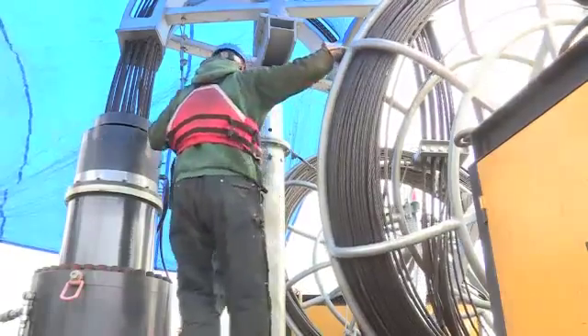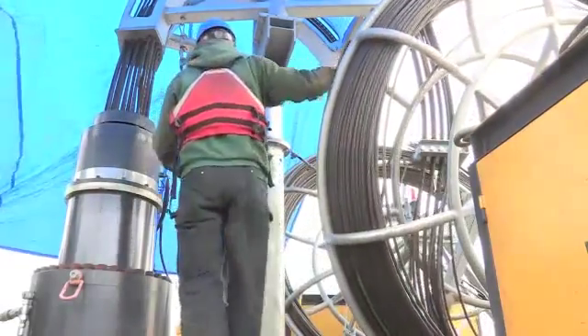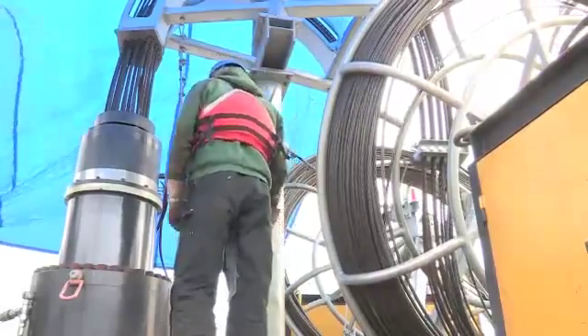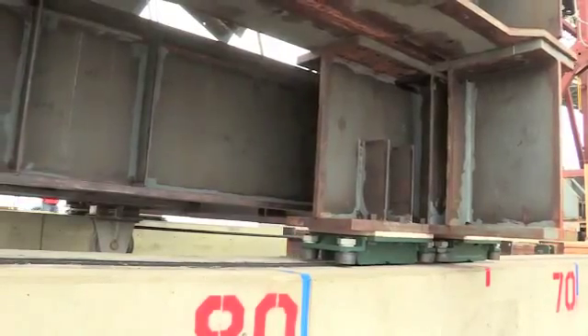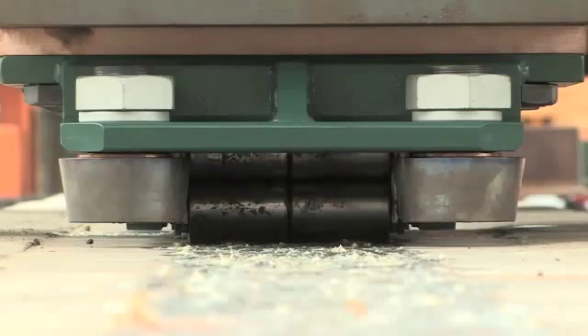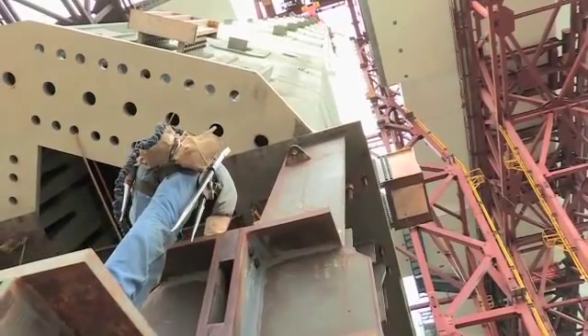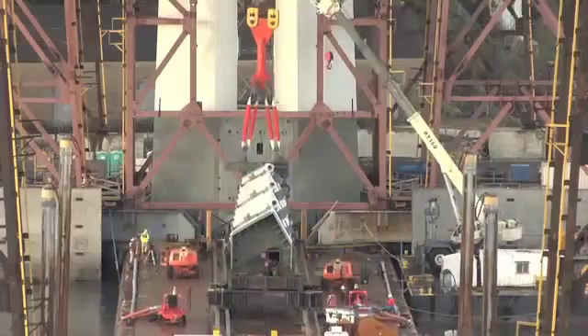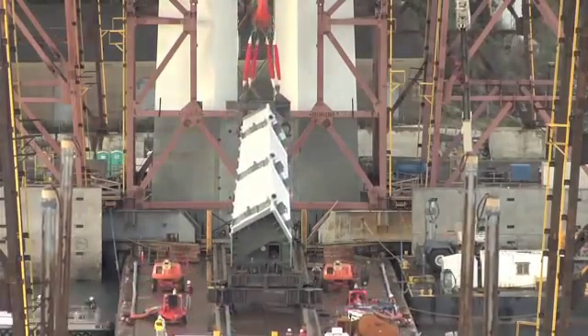The strand is actually taken up in these reels so that it doesn't unspool while the operation is taking place. The roller assemblies you see here are real workhorses for this particular operation. They're carrying over 617 tons of weight and they're doing it very efficiently as these segments are tipped into position before they can be lifted up into place on the bridge.